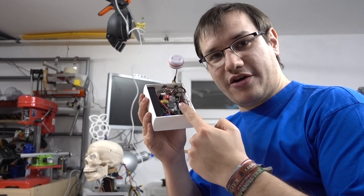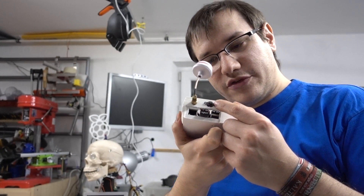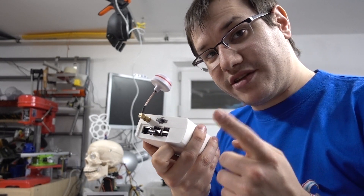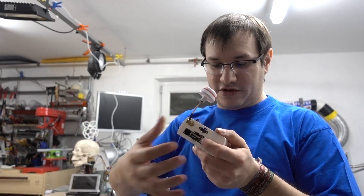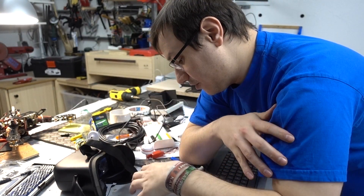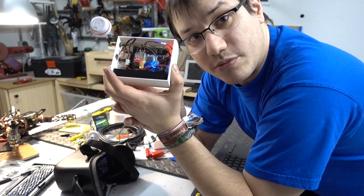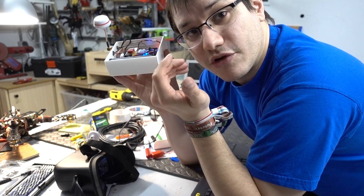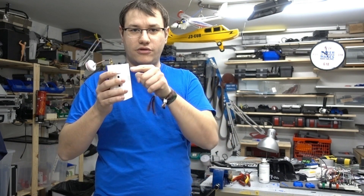That's the moment of truth. I've got the Raspberry Pi with the new head and new transmitter in the 3D printed case. Battery is attached, there's a power switch, and now the antenna is detachable. It's very important that you never power up any transmitter without the antenna, because it will burn out within seconds. It's also necessary to have a backup system: when you boot with an HDMI cable plugged in, it automatically uses HDMI and not the composite out — the video transmitter — so you have a screen for debugging and changing games. A key feature of the VR Pi is that you don't have to hold something heavy — you can clip the device on your belt.